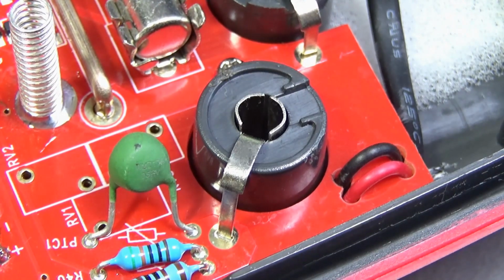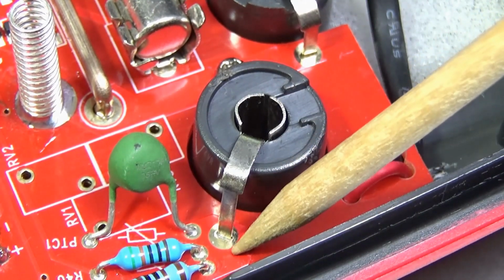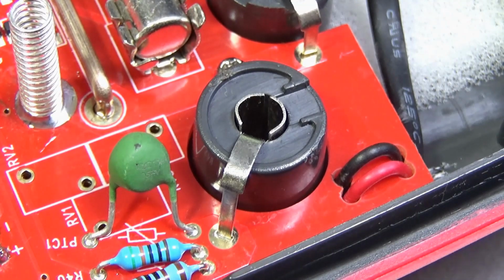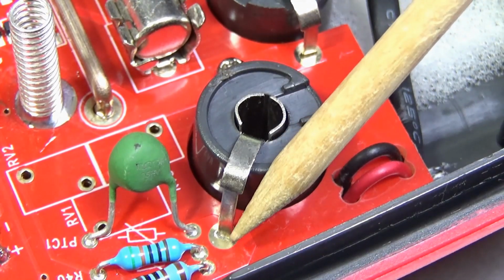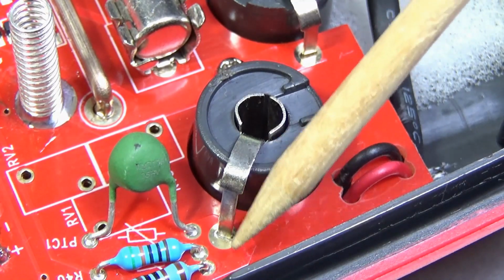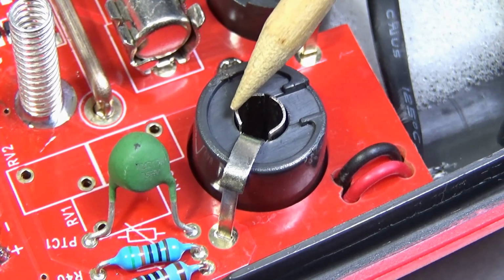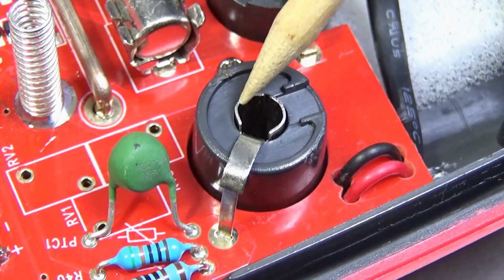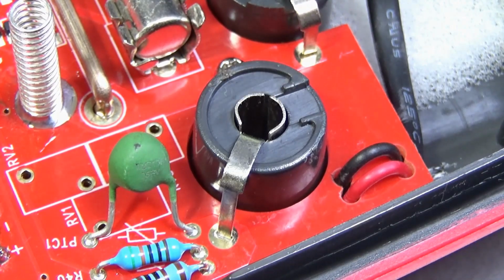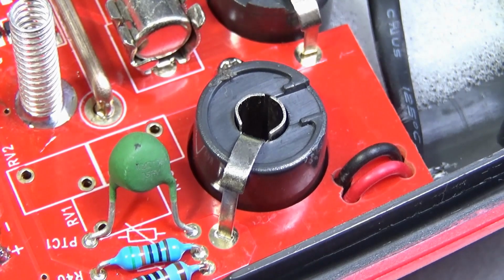What is important to me in banana connectors is the way I pick up the signal or the voltage and bring it to the PCB. The reason is that the more parts I have to assemble here, the more resistance I get in between. And the main problem is joining two different metals, like the solder and the copper, where we get a voltage drop. That's the reason why in benchtop multimeters, you will find they use a wire making contact and going to the PCB without solder, because they don't want to generate that voltage drop in between. That happens in the best ones, if you pay attention to it. So to me, it doesn't represent any problem. It's okay. I don't have any issue with it.